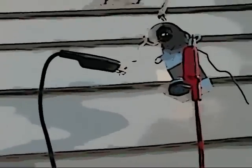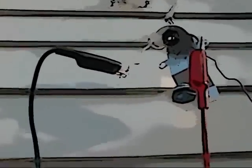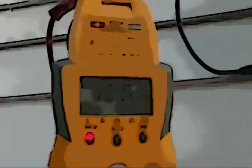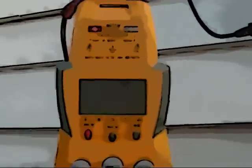Just bear with me, I've got to change the ratchets. I wanted to test my power to make sure I had 110, 115, 120 volts out here. I was getting some funky measurements when I was reading my security light — it was that ballast. I think the ballast was bad in it; it was reading off the chart like 150, 160 volts. I guess I don't understand it but it's bad. Alright y'all, I wanted to put my meter to my line here and make sure this is the line — the light is going to be the load. We've got 125 volts so we're doing fine. Let me get the power shut off and we'll get after it.